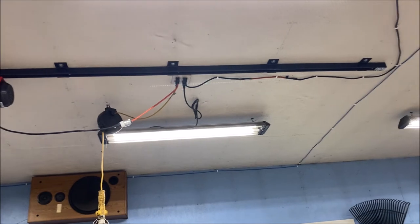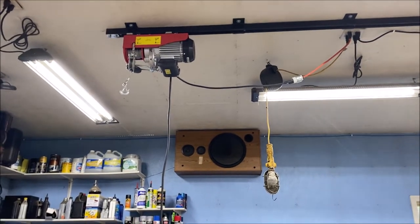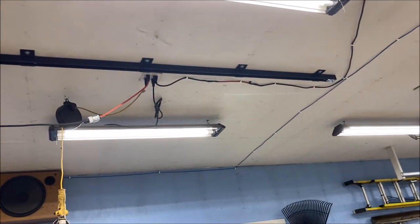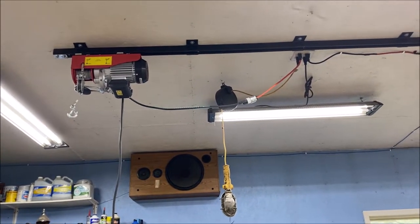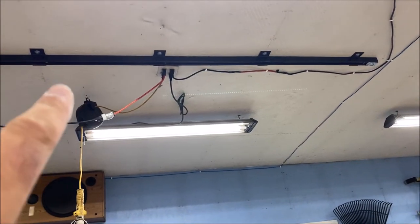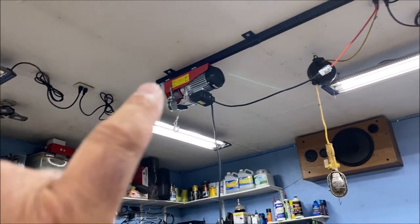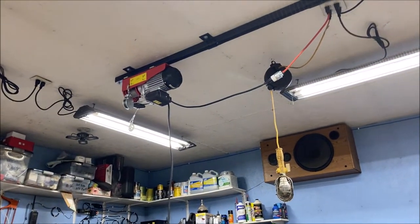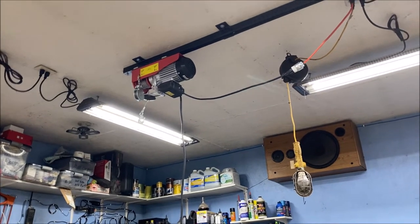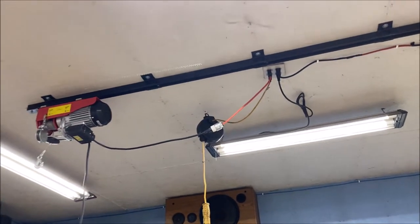I think this is going to be more than enough for what I need. This isn't going to lift anything crazy, but I think the winch is going to be the limiting factor as far as weight. I think this whole trolley system will hold around 800 pounds — the winch is kind of the limiting factor here. My angle iron is eighth-inch, so it's nice and thick. My three-inch lag bolts and the wheels up there for the trolley on the winch are rated for 1800 pounds. So everything is over-rated in my opinion, and the winch is the lower-rated component, which is good.